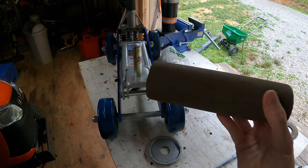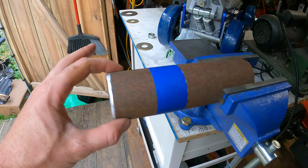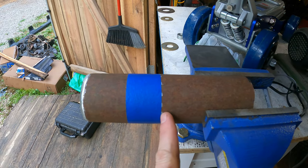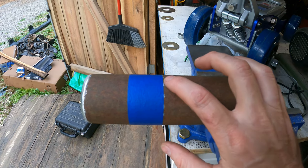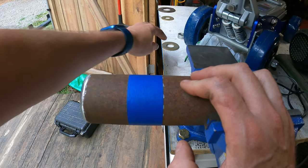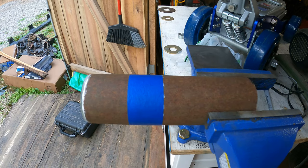Might even slap some paint on this when I get it welded up. I ground this side flat and made sure it was square to the barrel of the tube, that way it'll sit good and level. I measured as exact as I could with a sharpie and put masking tape on just to help me with a guideline. Now I'm going to cut this off with the cutoff wheel and sand this side to make sure it's square, then bevel it a bit so when I weld the washer on I've got a spot to build up some weld.